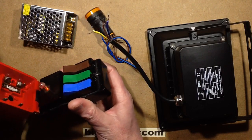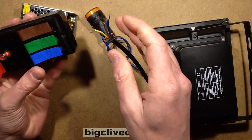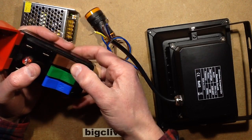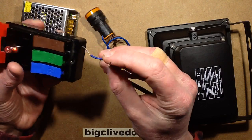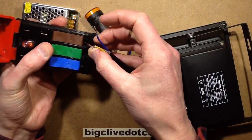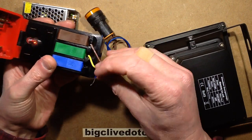It's not easy to knock the lid down - you actually have to push it down, and it's only once it's fully down that it makes electrical connection, and that also shrouds the connection at the same time. To connect, you've got the European colours: blue neutral, green earth, and brown live. To connect, you simply take the wires, press the key down, put the wire underneath, then release it. It's basically a spring-loaded clamp that makes electrical connection, so you put the live, the earth, and the neutral in.